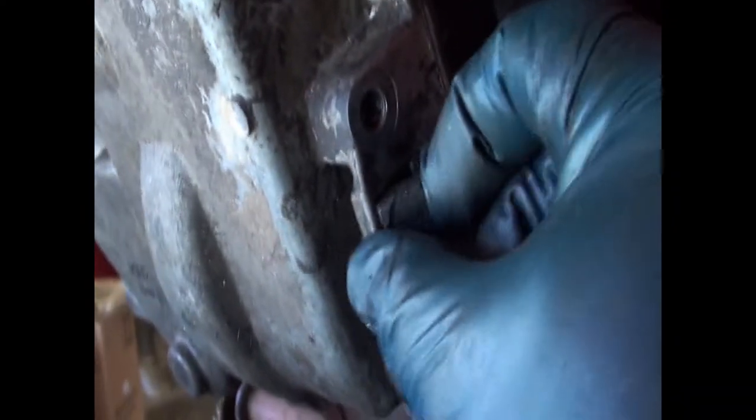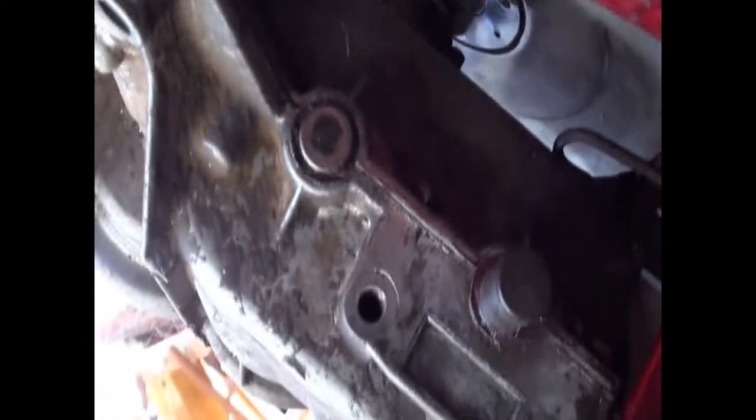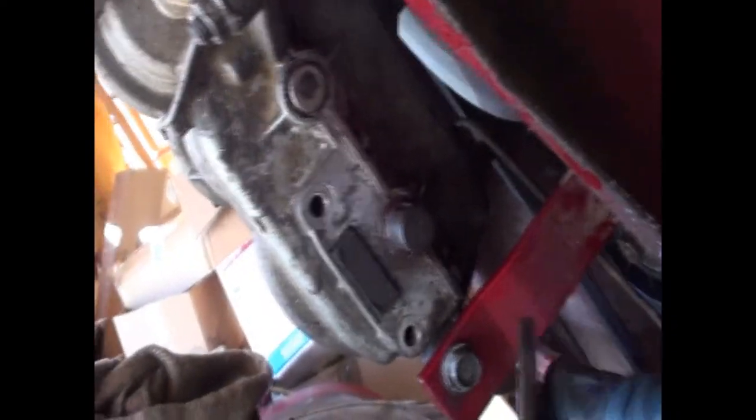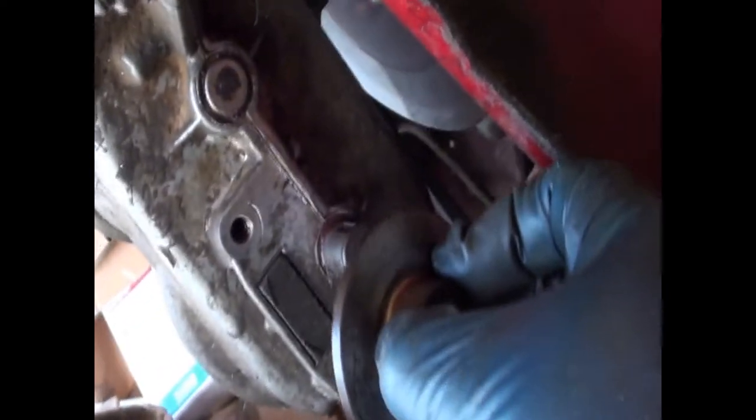First of all, you want to clean off around this and put it in place. The first thing you want to do is clean off the grease around this transmission spindle and around this little place here. This is one of two brake shoes. This wheel then goes on next — you'll see there's a half-moon key. The wide part of this disc brake — this is the disc itself — rotates, and there's a brake pad behind it and a brake pad in front of it. The caliper will squeeze the two brake shoes together as this rotates, bringing the machine to a stop.